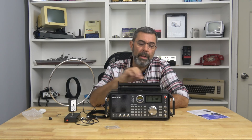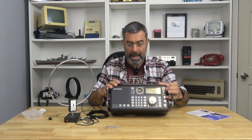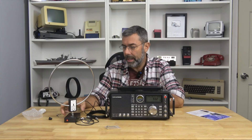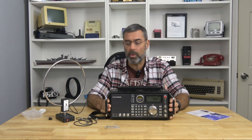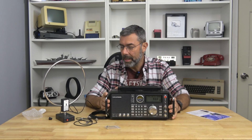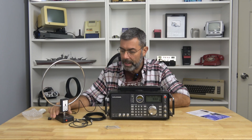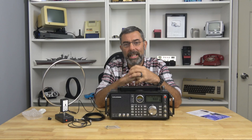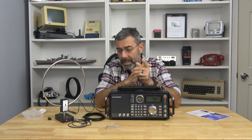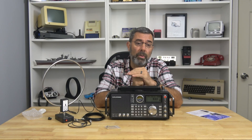Is it going to perform as well as it would if it were mounted outdoors? Absolutely not. It's definitely better than the standard antennas on these radios by a little bit, because it's a loop antenna and they do tend to perform slightly better, especially on the shortwave bands — maybe not so much midwave. This is more for shortwave. I've got another one of these that is outside — I've made a video on it, link in the description. That one is an outdoor passive loop antenna — not amplified — and I have it hooked up to a Realistic DX-394 in my house. The noise floor is pretty low with that thing too.